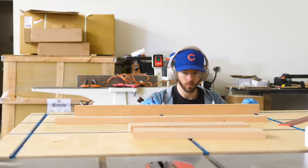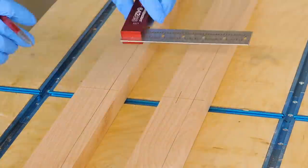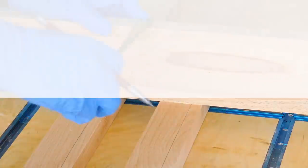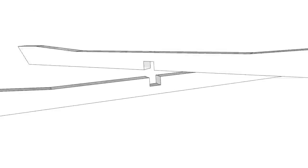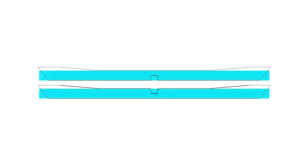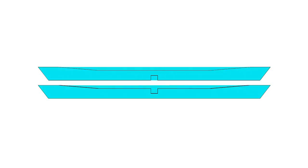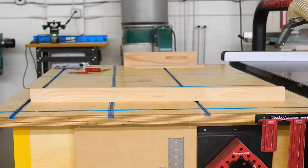With my stretchers all marked up, the last thing I wanted to do before shaping the actual piece was to cut half laps on each piece where they're going to join. This wasn't too hard, but we do have to plan a little bit ahead because of the particular shape. Where the pieces overlap, the stretchers are going to be an inch and a half wide, so each half lap needs to be cut three-quarters of an inch deep. But because we want to do this before we shape the stretcher, we need to make sure we cut an extra half inch deep into this piece. I made sure to label everything and double check my work so I don't get confused when making the actual cuts.